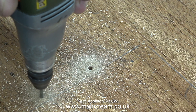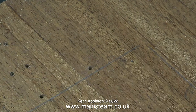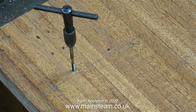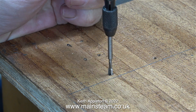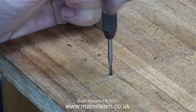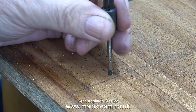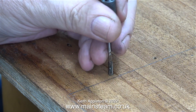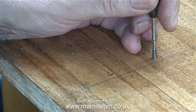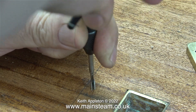What I'm doing at the moment is drilling some holes in the baseboard which I'm going to thread to mount some clamps that will hold the boiler in place. Now some people will be thinking you're going to drill holes in wood and thread the wood — well yes, I am indeed. This seems to work; it's from the model aircraft days. I'm going to use 4BA bolts to mount the clamps. The tapping size drill for 4BA is one eighth of an inch, but for wood I would always use one imperial size less so you get a tighter thread. Once all the holes are threaded I'm going to squirt a small amount of very thin cyanoacrylate or super glue into the holes. This thin super glue soaks into the wood and makes the threaded part very strong. Once the super glue is thoroughly set I will re-thread the holes using the same 4BA tap just to clean them up. You will be surprised how strong a bolt in a threaded hole in a piece of wood actually is.